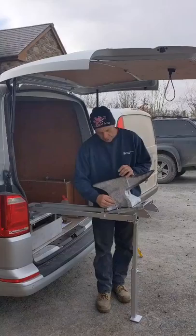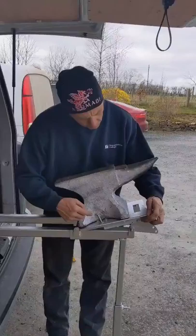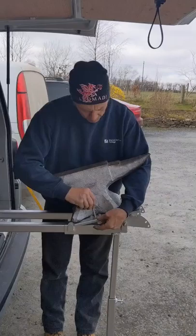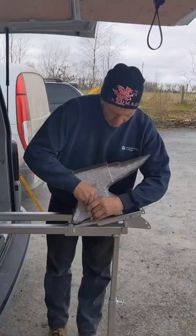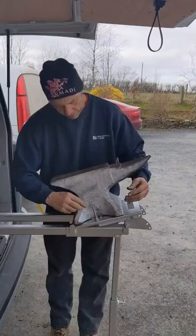Next, attach the anvil to the tray using the coach bolt. There are three different slots and you need the one nearest to the middle of the anvil. If you need to move between slots you may have to undo that bolt to lift the tray and choose the correct slot. It's really important that you tighten the nut all the way down to the bottom and tighten it up on the tray — this keeps the bolt vertical so it can't fall outward.